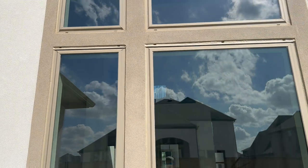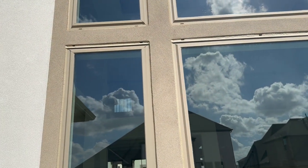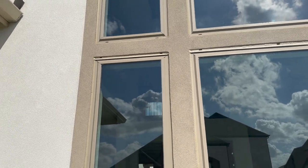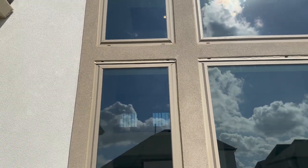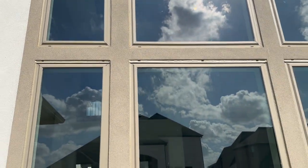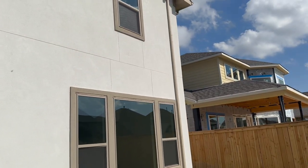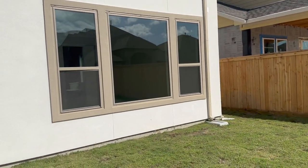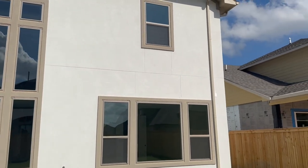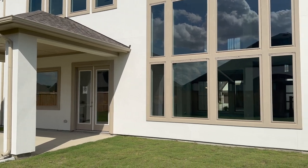Looking at the windows, you have overhead flashing on all the windows, which is really nice. They also added a gap in the caulking — caulking is actually not required above the overhead flashing, but they left the gap so if water gets behind the windows there is a drainage path so the stucco can dry out and prevent major damage. You also have control joints underneath all the windows and control joints every 144 square feet on the property. This is pretty much textbook installation of stucco.